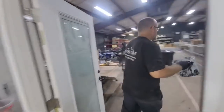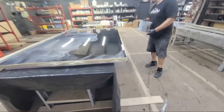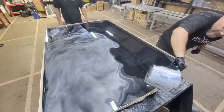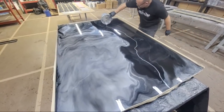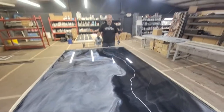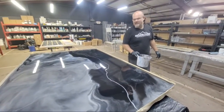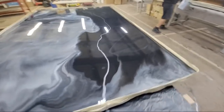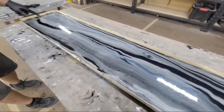Could you use half inch foam instead of one inch? Yeah, you could use half inch or even quarter inch foam. You could do this over masonite like we have on the floor. You can do this over anything that epoxy sticks to, which is about everything — just don't do it over three mil plastic, it won't stick. Look at the back wall — we poured this panel about two hours ago. Look at it evolving. See what I mean by those dark veins? Just giving you that realism — look at the sediment style.